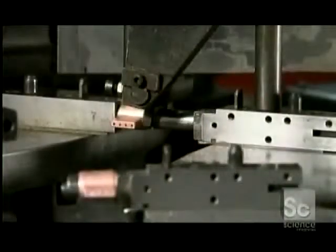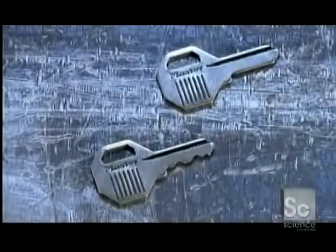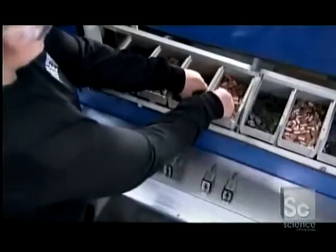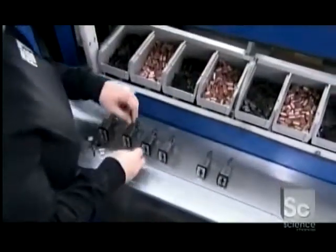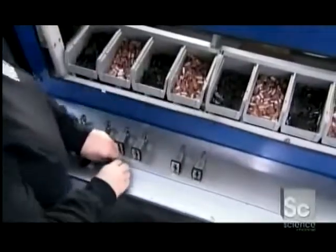The shell slides onto a brass plug. A key-shaped groove is cut into the plug, transforming it into a lock cylinder. A carbide cutter notches the matching keys. There are tens of thousands of key profiles — this sorting station holds just a few. The keys and lock cylinders are all numbered, and this worker matches them up, making sure there are two keys for each lock.